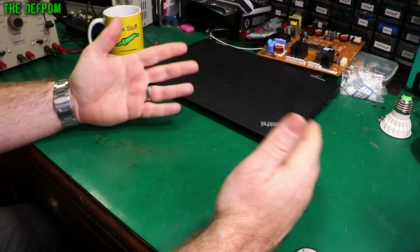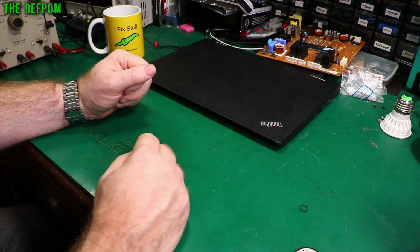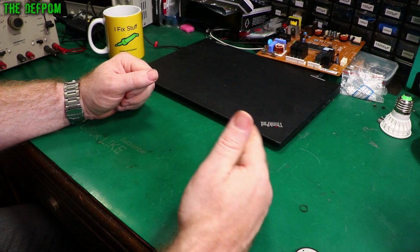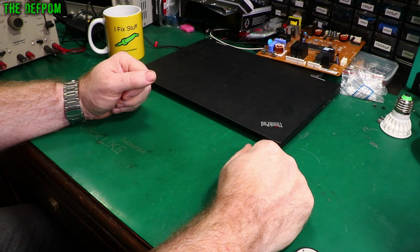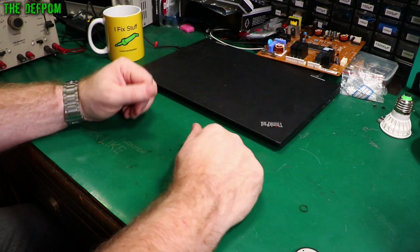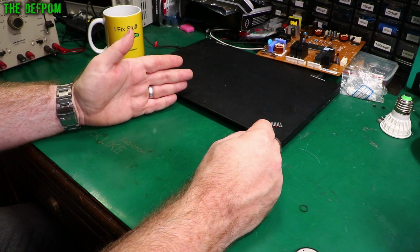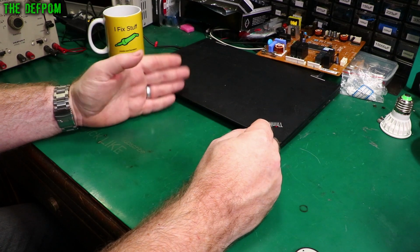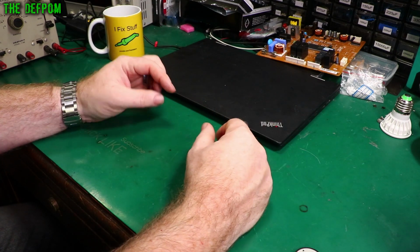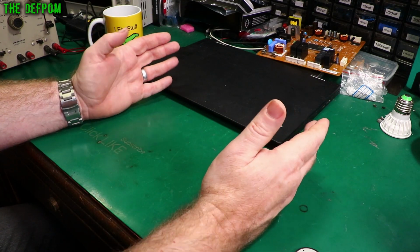So if it doesn't need Wi-Fi or doesn't need much power, I'd use the Arduino Pro Mini. If I need a bit more power or need Wi-Fi, then I'm going to be using the ESP32. And I'll base it on one of those two microcontrollers, in these circuits I'm designing. It's so nice to have something which you just go to. You know that part inside out, you know how it works. You've got a footprint for making circuit boards out of it. You've got all the supporting code for it and that sort of stuff.